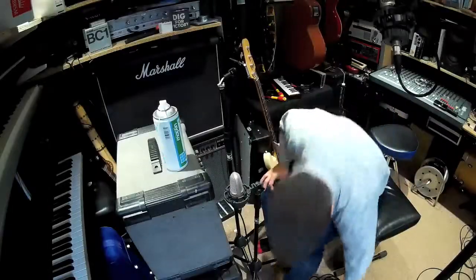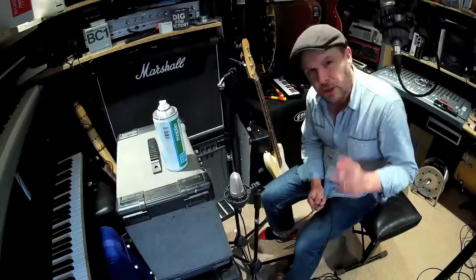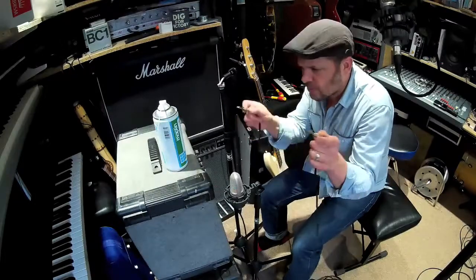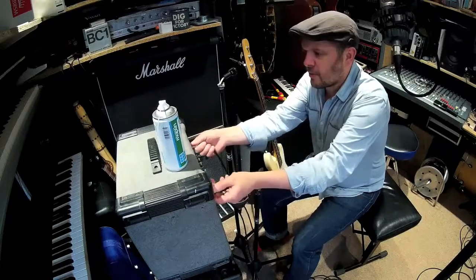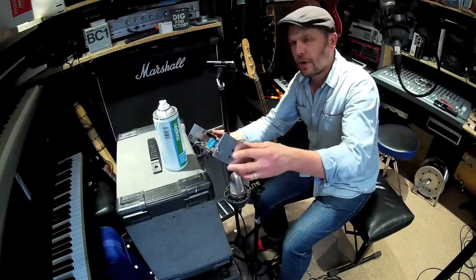Okay, that's been a few minutes, just to let the voltages drop. It's always worth checking that you can actually see the plug is disconnected from the wall — it's very easy to forget. Mains voltage is not very nice. I've taken the front cover back off here just to have a look at that input volume control.